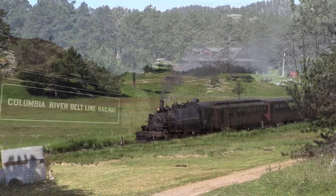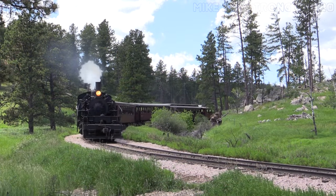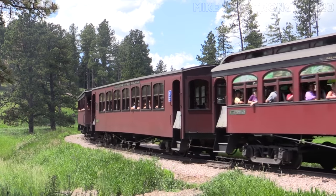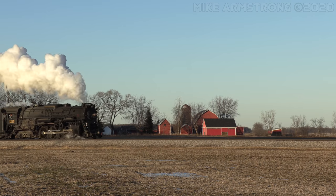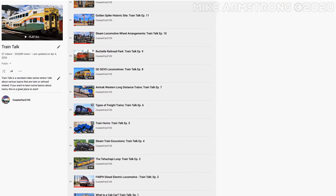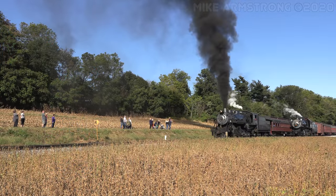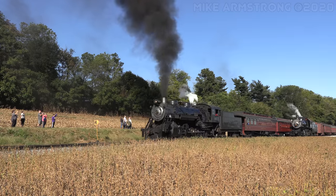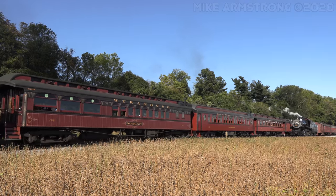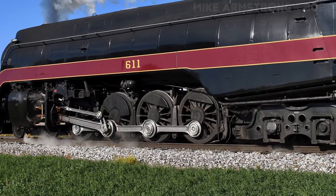A very small number of electric locomotives have also been constructed that are articulated, but for the purposes of this episode, we will only be looking at articulated steam locomotives. Before we get too far along in our discussion of articulated locomotives, let's go back to the standard steam locomotive design for a minute. In traditional steam locomotives, the driving wheels are all attached to a solid unbending metal frame that is part of the locomotive's overall framework. How tightly a steam locomotive can turn is dependent on how long the set of driving wheels is overall — the shorter the driving wheelbase, the tighter the locomotive can turn. In engineering terms, this is what's called a rigid frame.